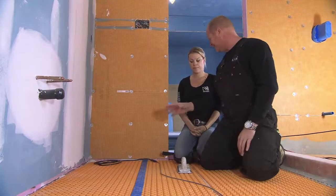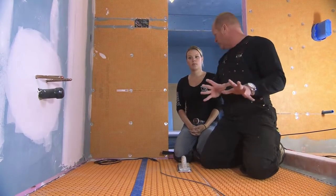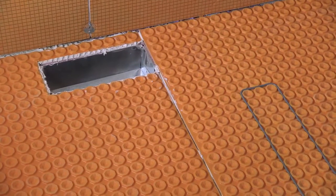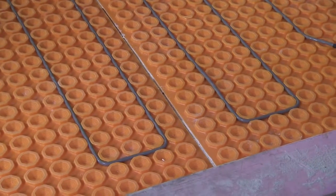Do's and don'ts: we're gonna be at least three full pucks away from anything. We don't need to put it under the vanity, and we don't need to install the heat cable under the toilet. Keep it eight inches away from any heat source — I don't care if it's a hot water pipe or a register in the floor — eight inches away. Loop it three inches, or three pucks, all the way through.